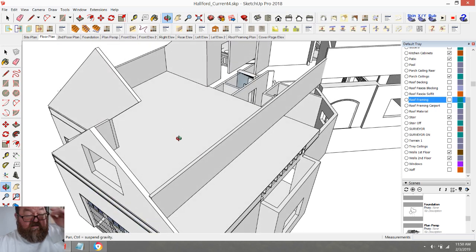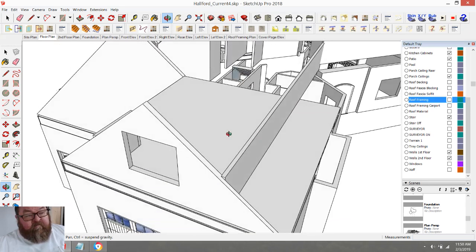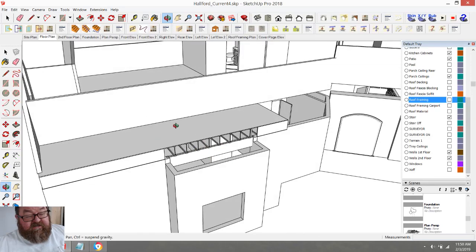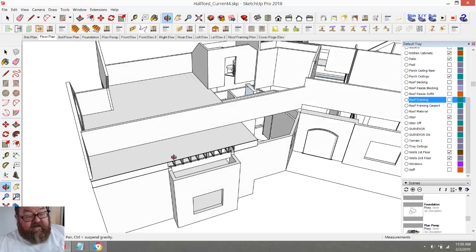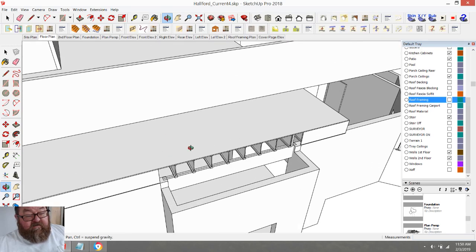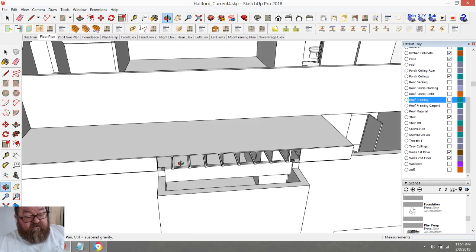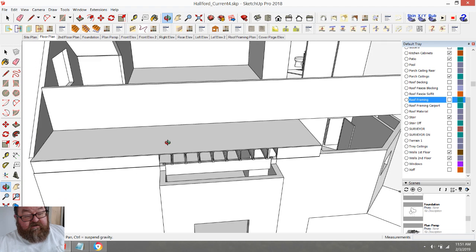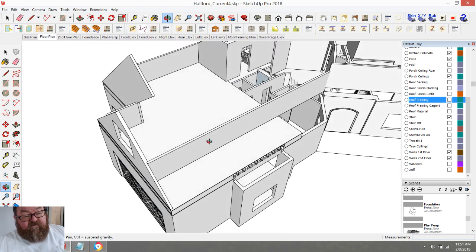If they wanted to put a pool table, as a matter of fact, I need to ask him, because this floor system is designed at 40 pounds per square foot. So he'd have to say, I want to put a pool table right here, and what we would do is we would just put a joist in the middle of each one of those, just where the pool table was going to be. Or we'd figure out what we'd have to do.